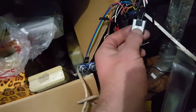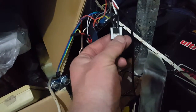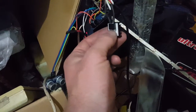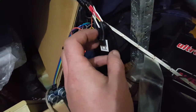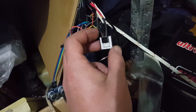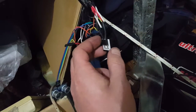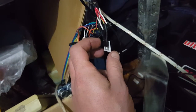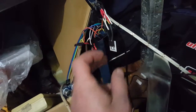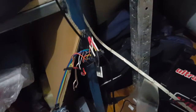I'll go into a little more detail now. There's a TO-220 or similar N-channel MOSFET — negative from the battery going in one side and negative to the LED on the other side, and a positive data signal from the Arduino Nano. That's pulse width modulation, a 0 to 255 range of integers, which is quite smooth.